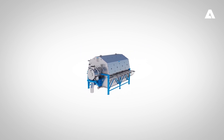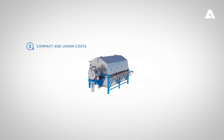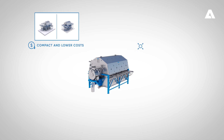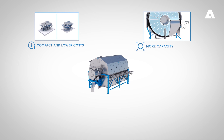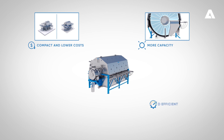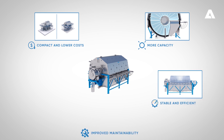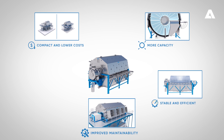To summarize, the new Andritz Lime Dry H solution adds value to your business with reduced investment cost and a more compact footprint in the lime mud handling process by eliminating the larger vacuum tank. More capacity from the same equipment footprint will be reached with larger filtering discs, which will lead to higher capacity or smaller equipment with fewer service items. Lower and more stable energy consumption in lime kiln operations is achieved due to more homogeneous lime mud feed enabled by center shaft axial movement and continuous pre-coat renewal. Improved maintainability is provided through the new hood design enabling easier access and machine vision throughout the Lime Dry H.